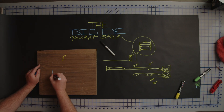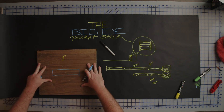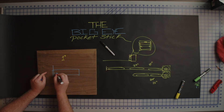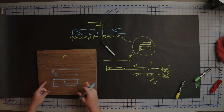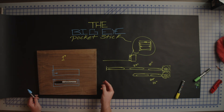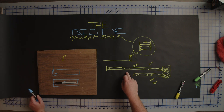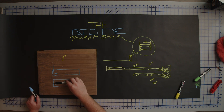The pockets were really fun to make — we used fluting. Normally when you're CNC machining you're creating pockets that go straight down into the material. So imagine this piece of wood tipped over as a cross section: your bit goes down and then over, clearing out that area entirely. But that's not great when you're trying to keep pins or something in there, because it's really hard to get them out, especially in an area that's under an inch and a quarter wide where you're just working with a single finger to retrieve the object.